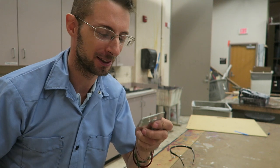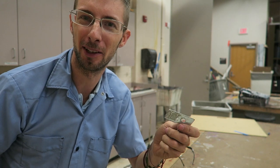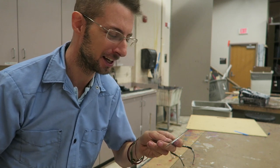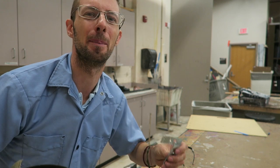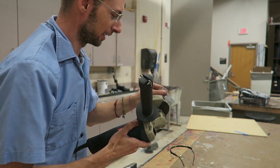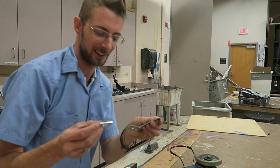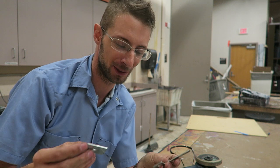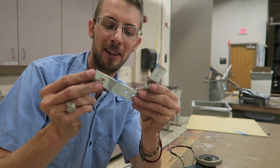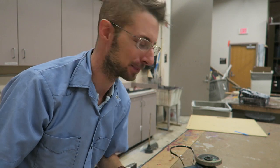If I were at my house right now, I would have a Dremel tool and some metal files, and I would make this hole that I just put in smooth, nice, and centered. But that's the beauty of this. You don't need it smooth. You don't need it nice. You don't need it centered. Good enough is good enough, and it will work perfect. So I'm just going to take my angle grinder and smooth this hole out right here. And what I did off camera, I thought I was recording, but I wasn't, I cut and rounded that edge off right there. That is perfectly smooth, and we're pretty much done at this point.